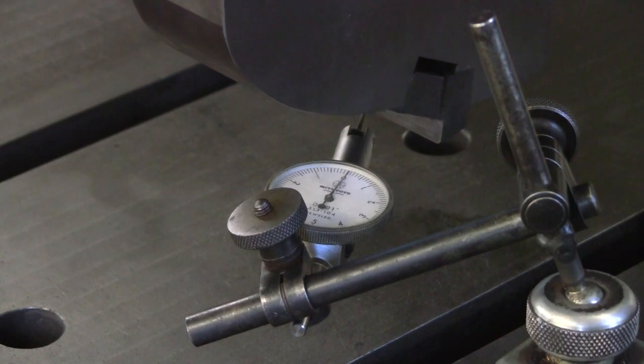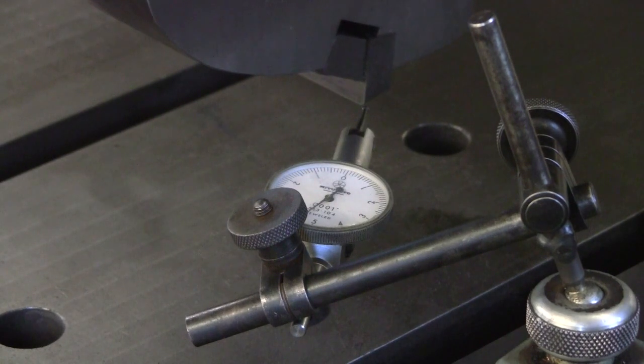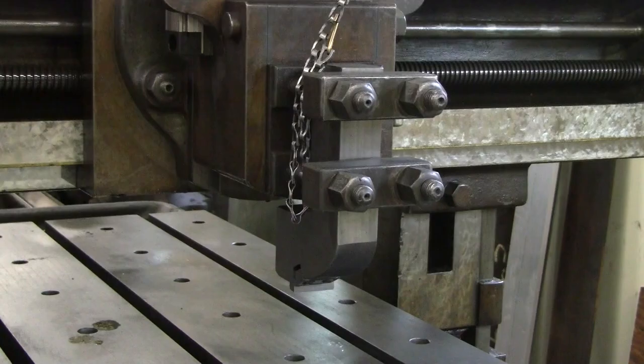Also, the cutting edge should have no cant — its edge should be parallel to the front face of the rail. Because the flat tool has such a broad edge against the work surface, the tool must not flex deeper into the cut as cutting pressure increases. This is what chatter is about — a cyclical digging in. With such a broad edge as a flat tool, the consequence could be severe. A very small increase in tool pressure will dig the tool very slightly, but because of the wide edge, it becomes a very large increase in cutting pressure, and thus an even deeper cut, leading to extreme chatter.